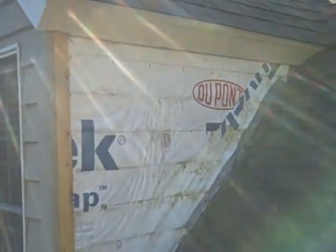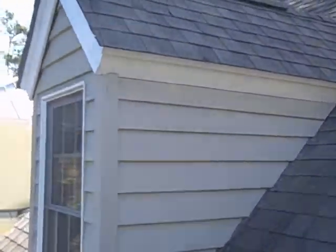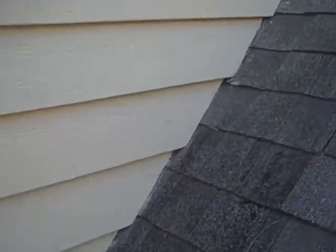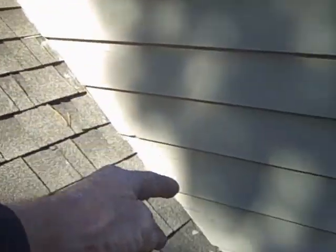One thing I can say about our job is I guarantee it won't have leaking going on again — guaranteed. We are changing all of the siding on all of these dormers so that situation won't happen ever again. This man should not have to worry about his siding on his house again. We've got rotten boards at the bottoms, cracked boards, too close to the roof — we know it's wicking. Once it goes above the flashing, there's nothing you can do, it's going in.